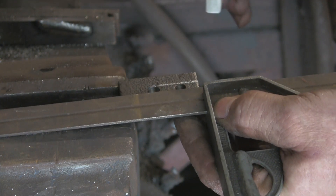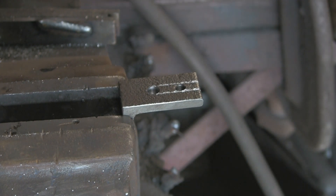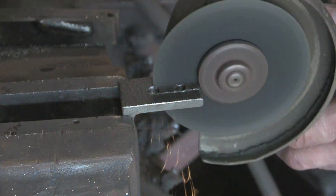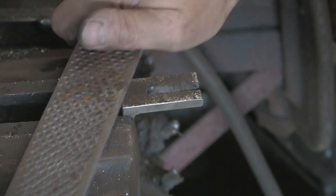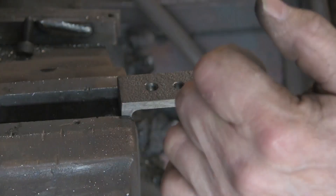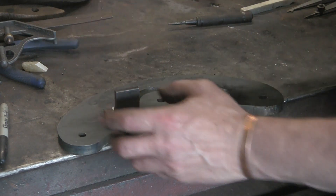You can see it's a rusty old piece of angle iron I managed to find - that'll be alright once it's cleaned up. I'm just going to slit them out with the slitting disc on the angle grinder, whip it through, then quickly tidy the edges up with the file. See if it fits. Look at that - perfect. Do the other one, which I won't bore you with. See if they fit on there now. Lovely job.